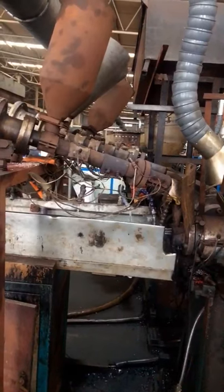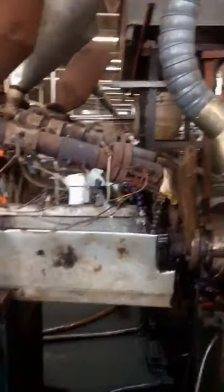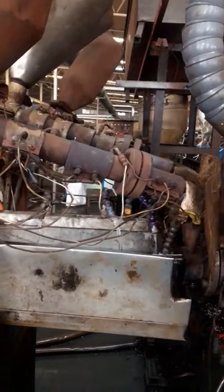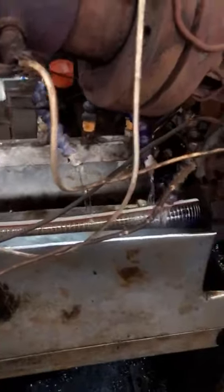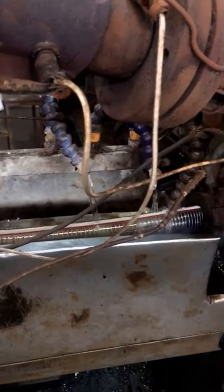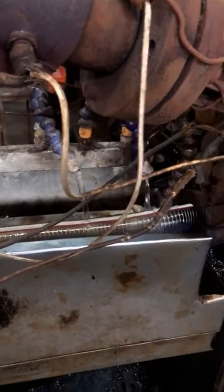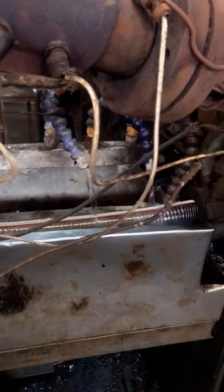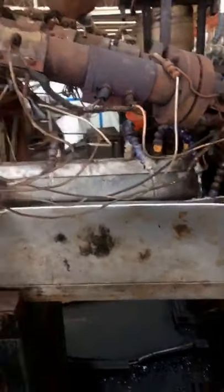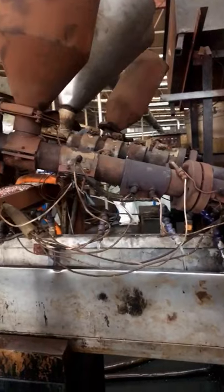The extruder will heat the PVC granules. The PVC layer will be made out of the extruder and is coated outside of the steel wire. You can see it here. And this PVC steel wire hose also has marking lines. There are three marking lines on the surface of this hose. These three little extruders are for the marking lines.